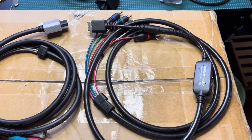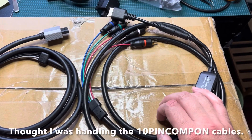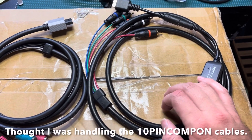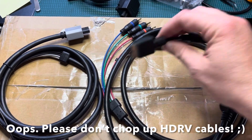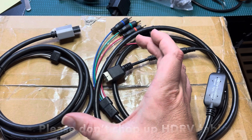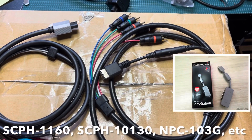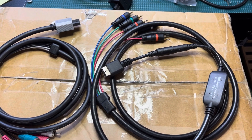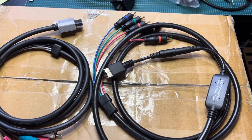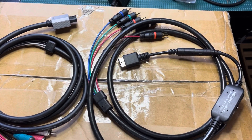You could salvage cables out of those too. But let's say you only had these and you needed to make a PlayStation RGBS cable — you could add them to a PlayStation connector and then plug that connector into one of those light gun dongle adapters that has composite video and audio outputs on it. Sometimes they even have one with S-Video. Then you could draw sync off of that composite video jack and get RGB for your component cables plugged into the pass-through multi-out jack.